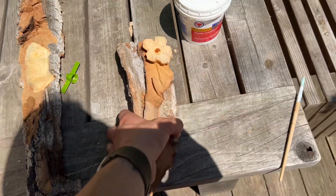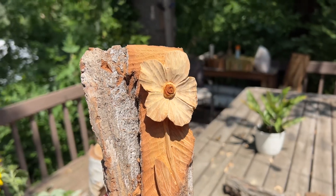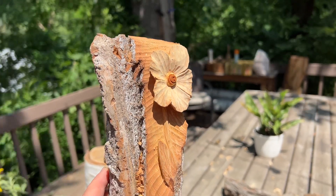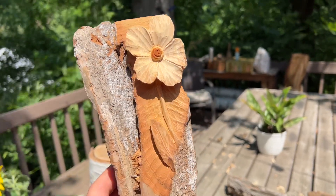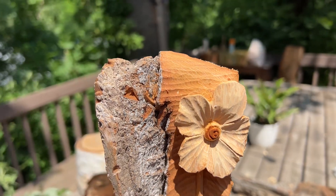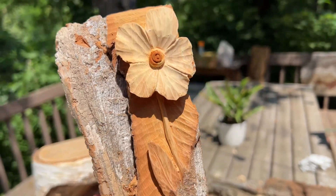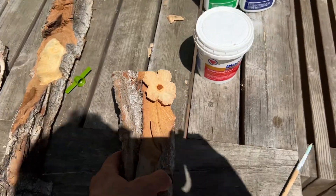This is kind of an interesting thing — on Eastern cottonwood, it really shows up nicely. It really brightened up the wood. I like the effect it has had on the carving. You can see it's about a shade or two lighter than the cottonwood bark below it. It's not yellow, it's not green — it's just a lighter version of what the wood already is. Lesson learned: always do a test piece before you work on your fancy carvings.